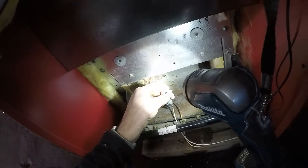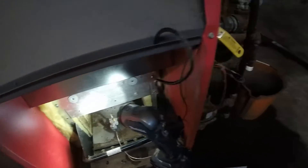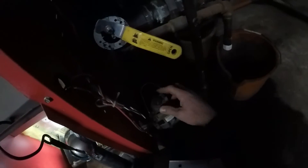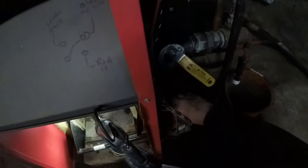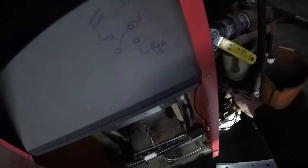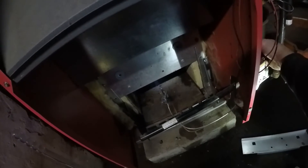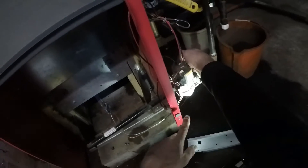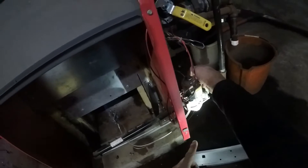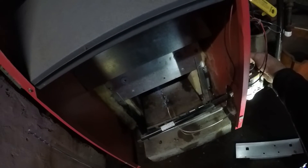While we're in here, I think I'm just going to grab another thermocouple. I've never seen a bulge on a thermocouple like that. Just for kicks, what we could do is try to light it. This goes over to Pilot — that's on, that's Pilot. Usually if it's a good thermocouple, it conducts heat and then converts that heat to electrical energy in the form of a very small, minute current. The thermocouple is typically pretty good — you don't have to keep your finger on the reset button to force feed the pilot gas. Hold on to it here for another couple seconds.